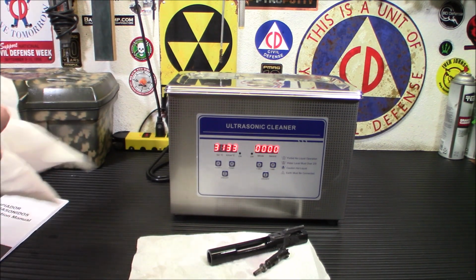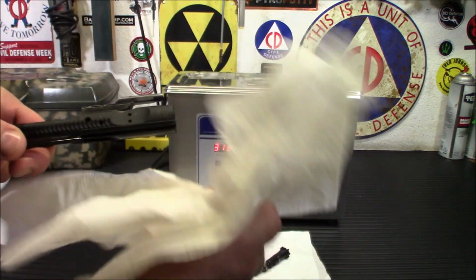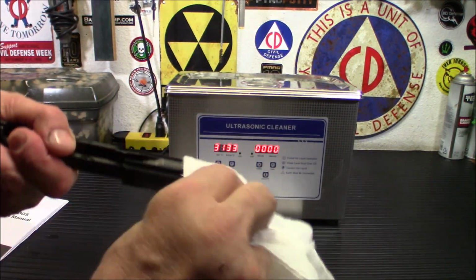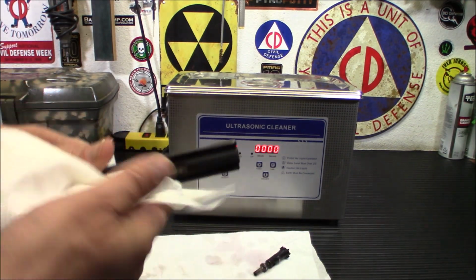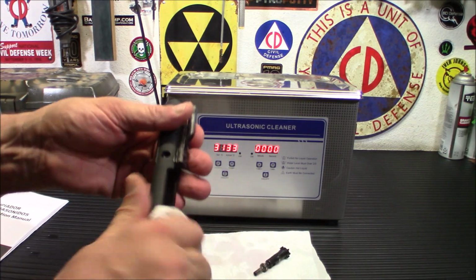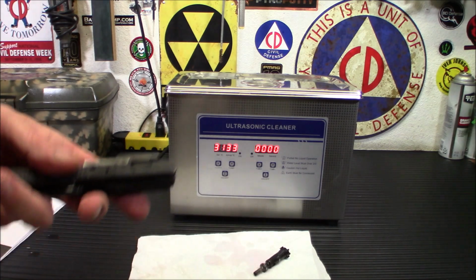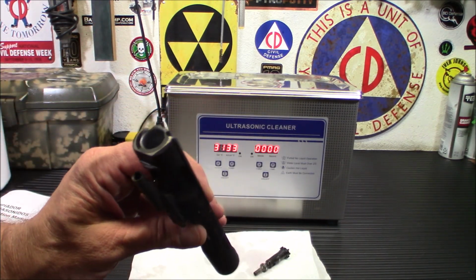Now if you're using this on these type of parts, you do want to make sure that you thoroughly clean and degrease the item. You know, spray it down. Make sure you get all that water displaced off there. Sometimes a heat gun might be good. My hands are full of it too. What I sometimes do, if you don't, is you get some brake cleaner and just spray it down in there.